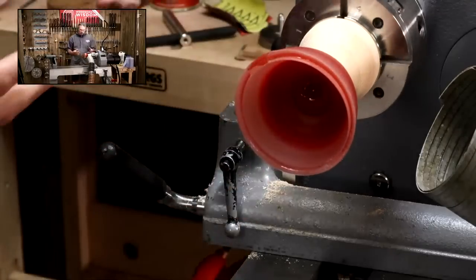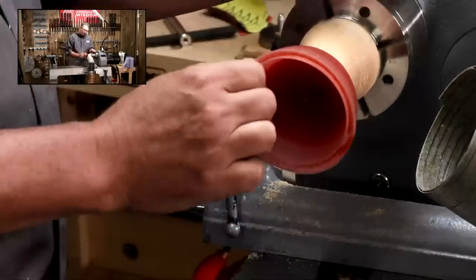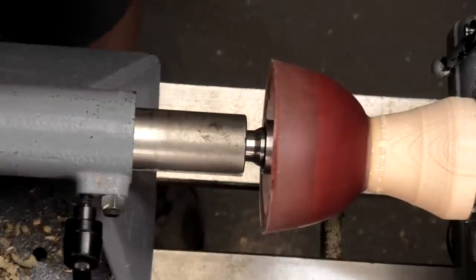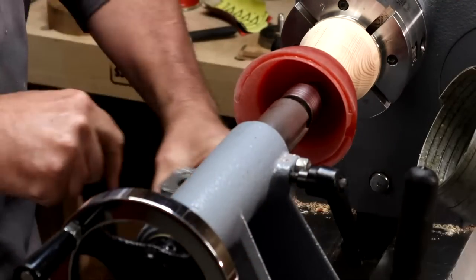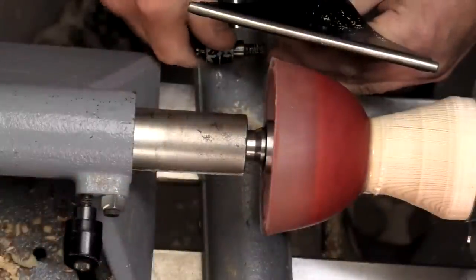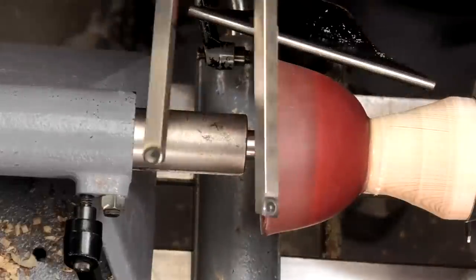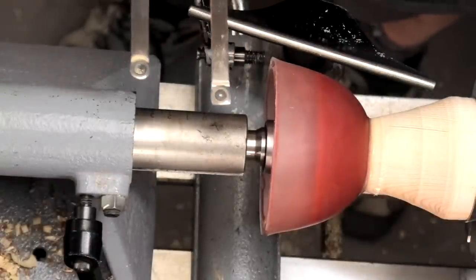I just need to true this up properly. You can see the top of the casting — it's a little bit rough. I want to true that up and clean the outside and inside to a nice finish. I'm going to bring the tailstock up for a little extra support initially, then take it away when we come to do the inside. I'm going for a fairly small tool rest to start. I've got the EasyWood tools here with negative rake tips on both of them — they're going to work well with this material, with the resin.